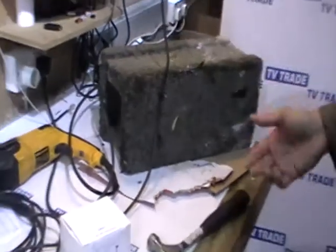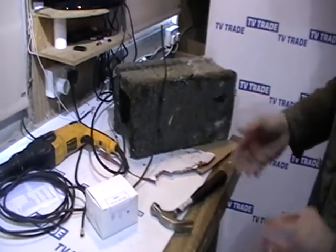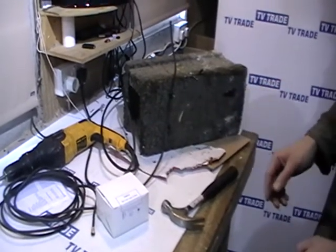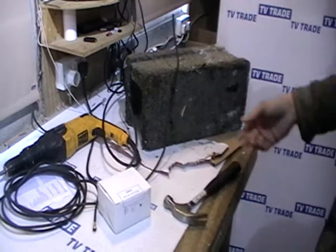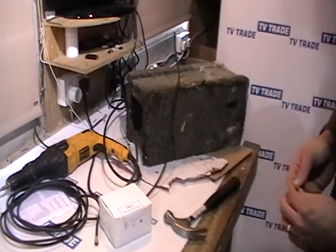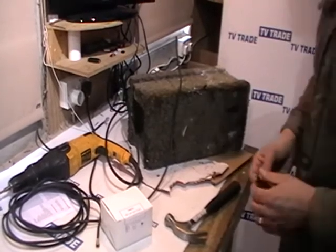Sometimes you can have very heavy, dense concrete where it's almost impossible to get the nail in, and this can lead to a lot of frustration where you're either not able to tack or not able to securely tack the cable onto the wall, or you do so after maybe 20 attempts. In such circumstances, a much easier and neater solution is to use nailing plugs.